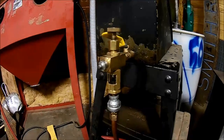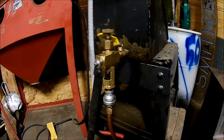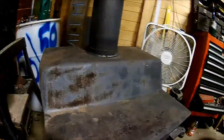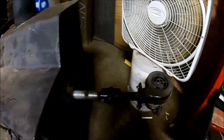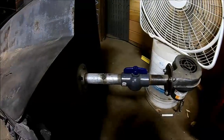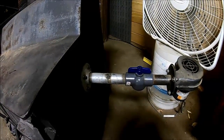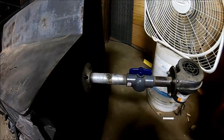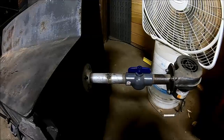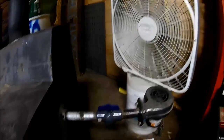When I'm ready to let the stove cool down, I shut the ball valve off and just continue to let my little squirrel cage fan run. I also put a ball valve on that fan — another modification I made — because initially it was just too much airflow. I had to dampen that down because it was wanting to blow smoke out through my stove.